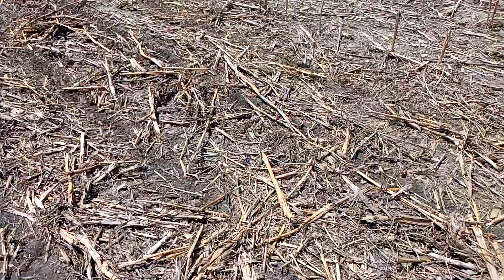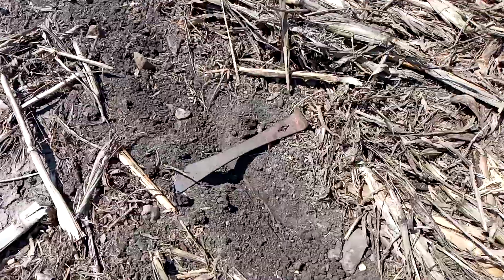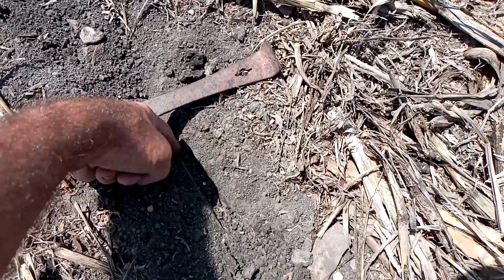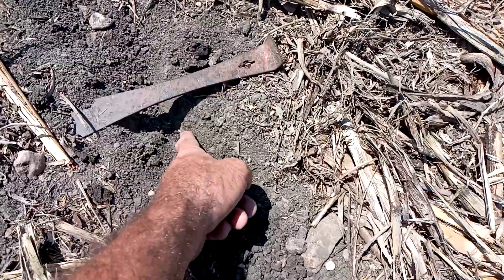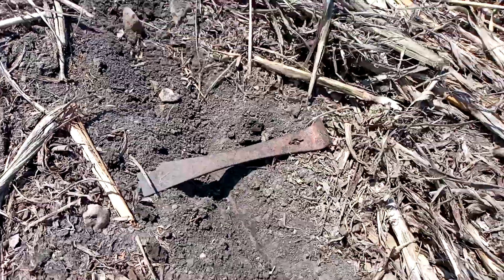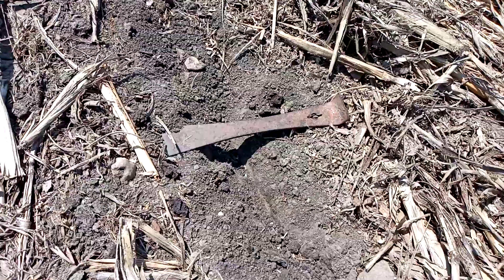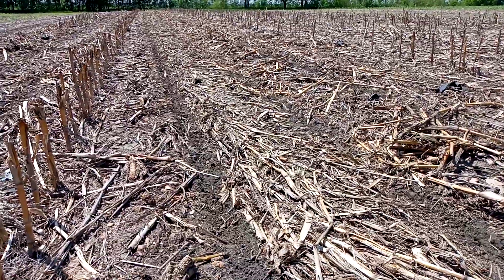After planting a little bit and getting things set up, here's what I'm getting. This is my trench — here's the seed at the bottom. We're about two, two and a half inches deep and we have nice moisture there. The sidewalls are almost all crushed all the way down, and that's what I'm looking for. Nice pretty rows, residue cleared.